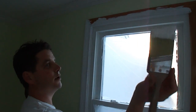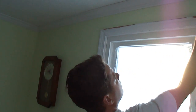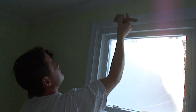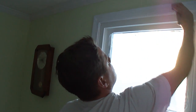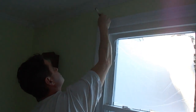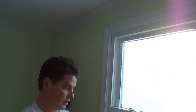I reload, put a lot more on the brush, come into the middle and flatten out the brush — that's going to spread a lot of paint. I work it across and into the corner. For the top side, I just do it like that, come down into it, work the brush into the corner, come down, and go once across, coming back into it. That takes care of that section.